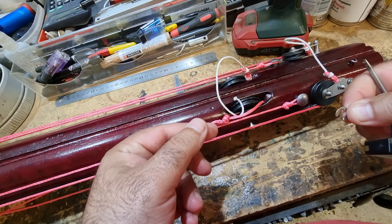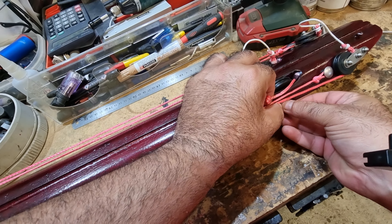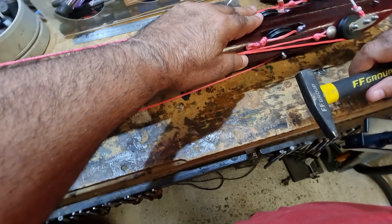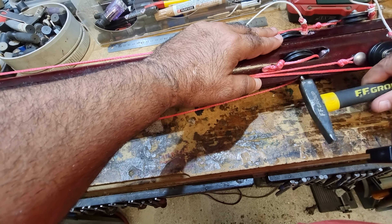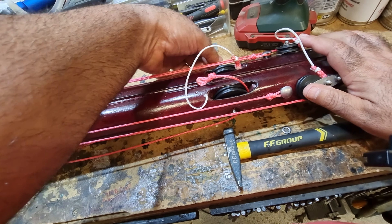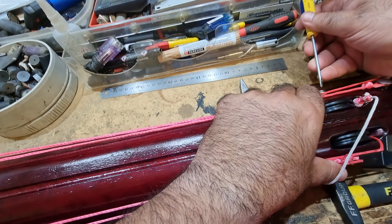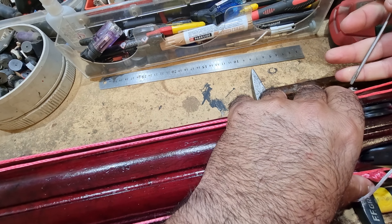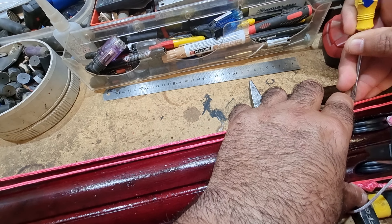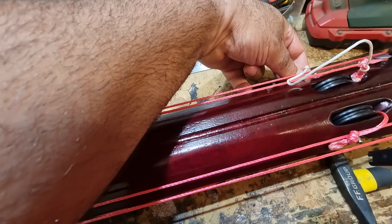This is the safety pin — the safety pin has come off. We take out the washer which keeps the band in place, and then we simply take the roller out. We knock it out like this. In order to get this out, we do the same on the other side. So you're going to have two safety pins and two washers — those are the only parts that you mustn't lose. I always add extras, by the way. Obviously this side comes off easier.